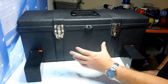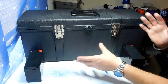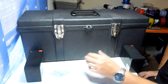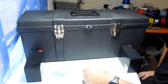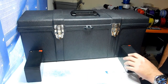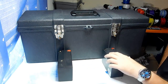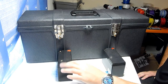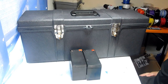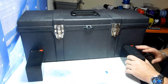On the inside I'm going with two 8 amp hour batteries — one in each corner. If I put one big square battery in the middle there wouldn't be enough room, and the weight distribution would be off. Instead of a 15 amp hour battery in the middle, I'm going with an 8 amp hour in each corner. The way you wire two batteries is in parallel — positive to positive, negative to negative. You still have 12 volts but double the amperage, so it's effectively a 16 amp hour battery.